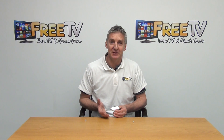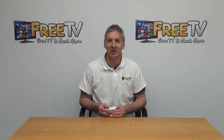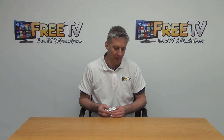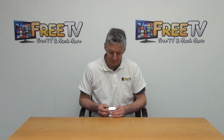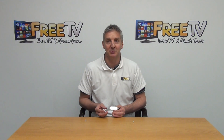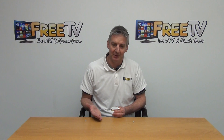I've used these personally, installing this myself, and it can be a lifesaver. Typical reasons you would use it: there's a dish you can't access — maybe on a communal block — that's been poorly aligned and you need to boost the signal, or you have a very long run of cable and need to boost the signal along the route. You just buy this with a couple of F connectors, attach it on, and it will give that dB boost.